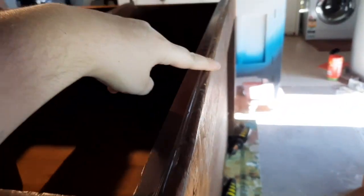This base part has come away from the body and I believe the screw has threaded — well, it's not got anything to bite onto because it's pulled through. So I'm going to actually pull this entire piece off, which is good because it'll make it easier for me to get in and sand around these parts and easier to sand this part. I'm going to clean under here whilst I'm down here because it'll be easier to do now.